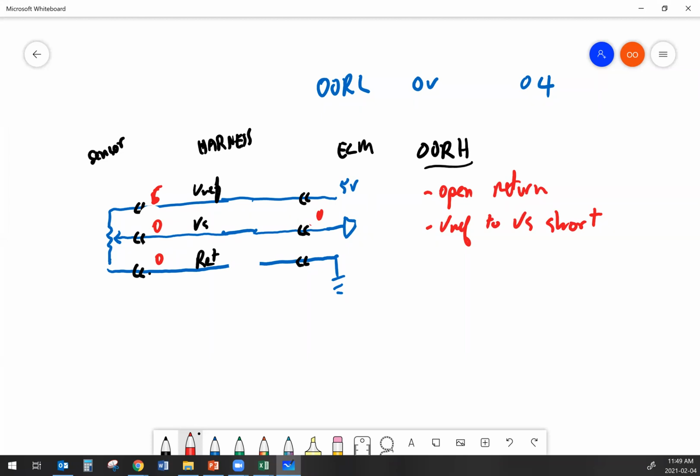So again, with that fault code state of change troubleshooting, if it goes away, you know that you've changed the state of the fault, and you know that the problem is quite likely in the sensor or the harness, depending on what your live voltages were with everything plugged in at first. Something you want to be aware of: anytime that you see 5s across the board on a sensor, usually that means that you've got an open ground. That's a pretty common thing.